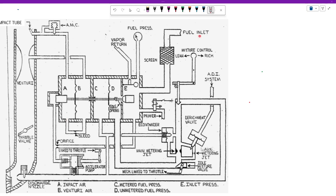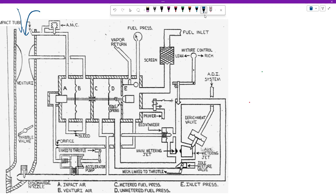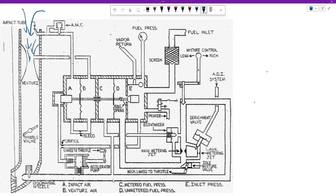Let's talk about that control unit and how it works. The first thing is the airflow. Air is going to enter in through the air filter and through that induction system into the carburetor — it's a downdraft carburetor. The first thing it's going to encounter is an impact tube right here. So we have an impact tube which is going to have this pressure air coming into it. Whatever air we have coming in is going to go this way and fill up chamber A, pressing against this wall right there.